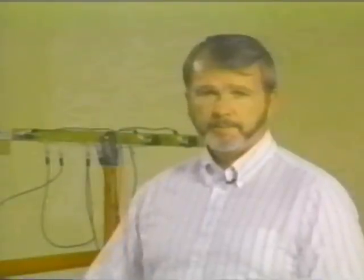How well is it stapled to the pole? The resistivity of the pole. How good is the connection between the pole ground and the neutral? All of these are unanswered questions, and they would be unanswered at every work site. The best possible thing to do with a pole ground in your grounding program is just simply to ignore it and not rely on it to do anything for you.